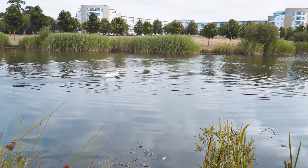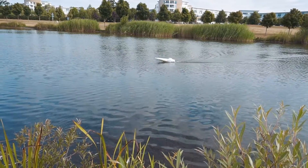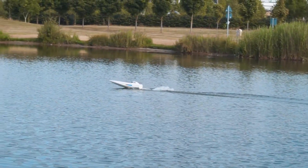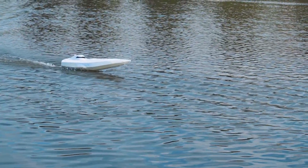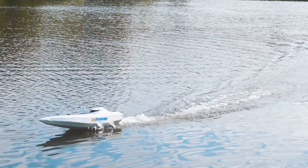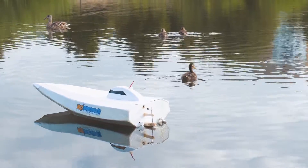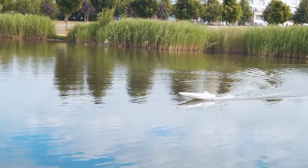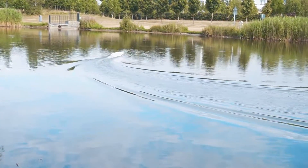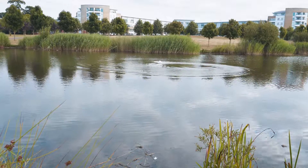It's not all perfect but it is working a lot better. If the rear stabilizers or fins are not aligned, you will notice that it will turn without any commands - that's why they must be trimmed well. I also believe that the position of the rudder is making problems there. But also another problem happened, so back to the design table.